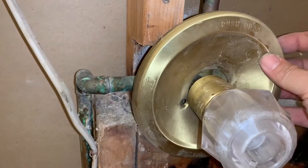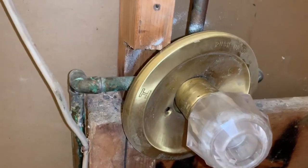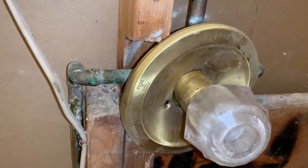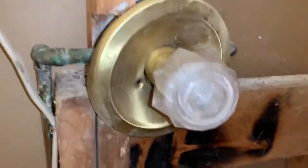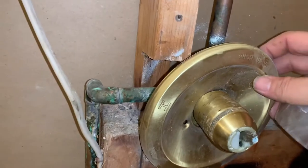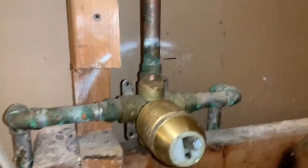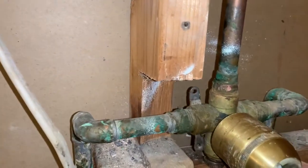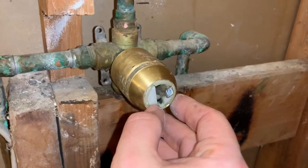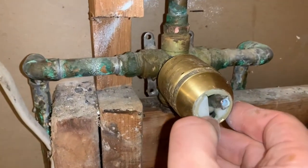For demonstration I put this back plate — obviously this goes over your tile work — but you'll open the screw that holds the knob and take it off. You'll definitely take the plate off, and the next thing is that you have to open this ring. I'll show you how to do it with my hand, but actually I use a screwdriver tapped a few times.